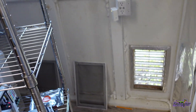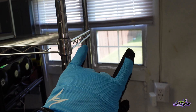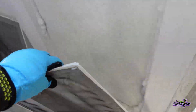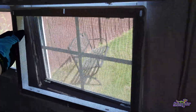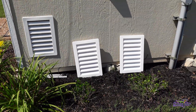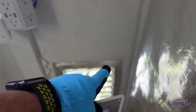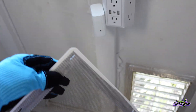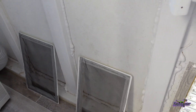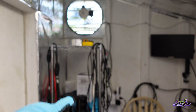The next thing we're going to do in this video is take some wind measurements to see how strong our cross current is from the various intakes along the back. We've got the windows closed at the moment — they're normally closed — and what we're going to be adding is two more intakes right here. These are actually larger than the window itself, so putting these in should be the equivalent of having those two windows open all the time. I've been breaking these out of the packages and getting them ready. I'm going to do a little insulation with this tape just to seal these up and get everything prepped. We'll then take measurements to see before and after what the wind pressure looks like.